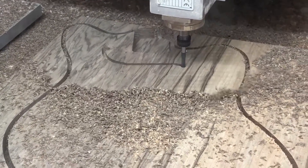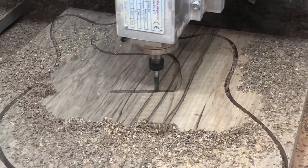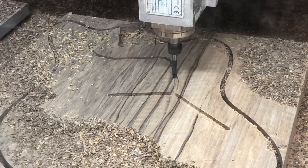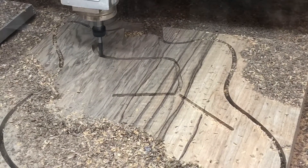Look at that — that's at least a quarter inch depth of cut and I just had no problem at all. I probably could have gone a little deeper, but I don't have to worry about losing steps since it's all servo driven. I'll have to do a video on it sometime, but there's some of the process.